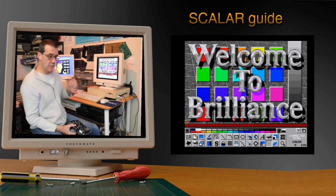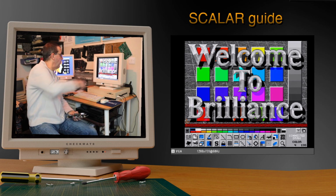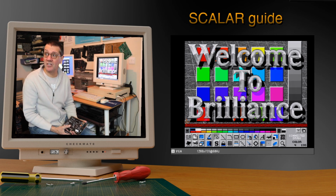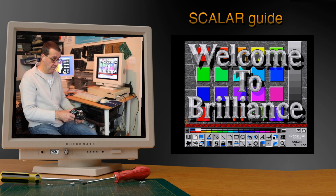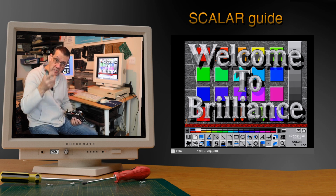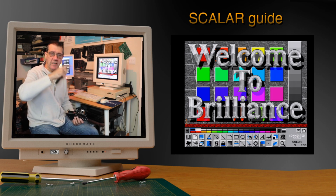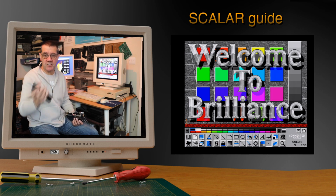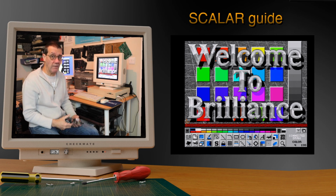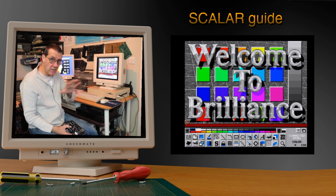Now, important to understand, it will look sharper, but the reason for it is, if I press info, you can see it's at 50 Hertz. Yeah, right at the bottom there. 1280 by 720, 50 Hertz. The problem we have at the moment, and this is only at the moment, it's going to be fixed soon, is that the 1280 by 1024 and the 1024 by 768 modes don't have a 50 Hertz frequency mode. Yeah, it's just firmware, because I didn't realize about this.